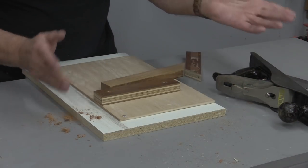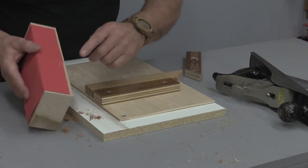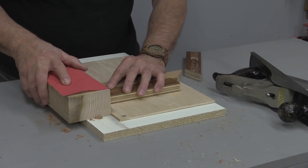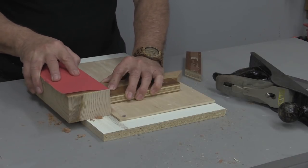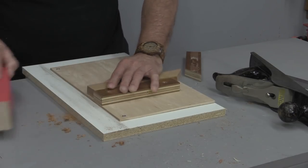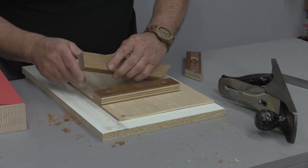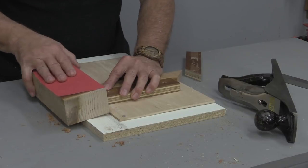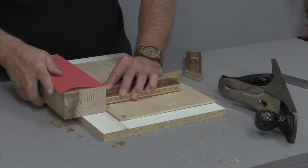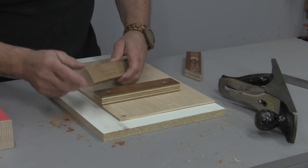But look — you don't need to use a plane. Planes are expensive, sharpening stones are expensive, it takes a lot of time to keep them tuned up, and sometimes you just need to do something quickly. Brad suggests: why not just use a block of wood with sandpaper on it? It works just as well. He uses thumbtacks to tack it down; I just use staples. You can use different grits of sandpaper, run it along, and it does an amazingly good job. You don't need expensive planes and sharpening tools — if you only need to do something once in a while, this is a great way to emulate a shooting board. Thanks for that, Brad.